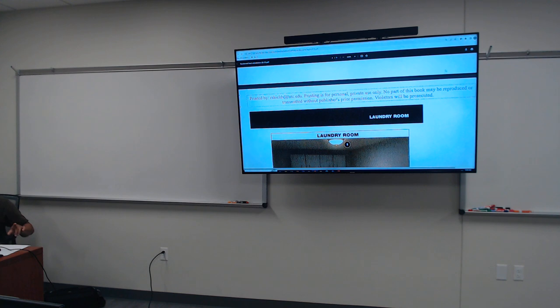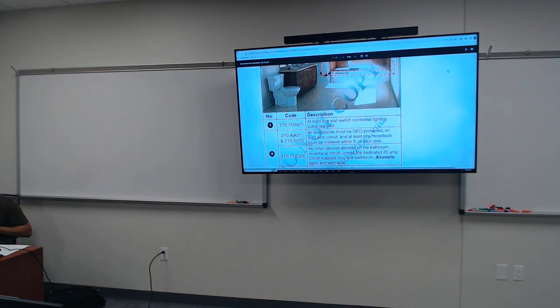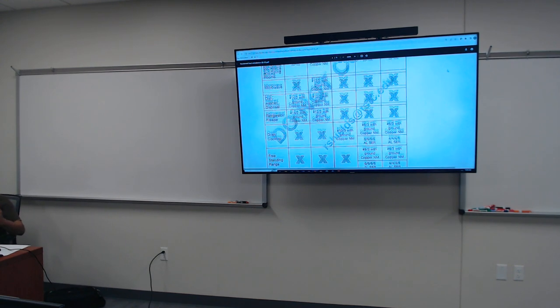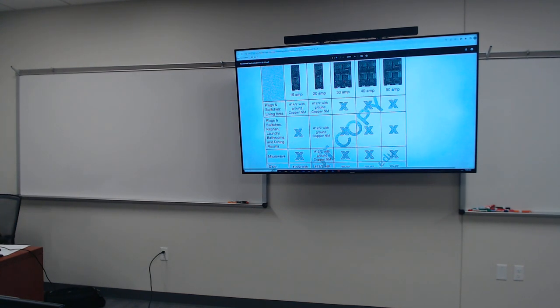But it has to be 20 amp, and when it's 20 amp, question: what size wire, what size conductor? If it's a 20 amp going to the bathroom, what size wire? Not 14 gauge. 12. 12 gauge. And that goes back to that exactly, right? So when you question yourself, you go back and look in the bathroom, look at that on the TV: what size conductor? 12. 20 amp, 12/2. 12/2 basically means a hot wire and a neutral. And remember, the grounded does not count. All right?